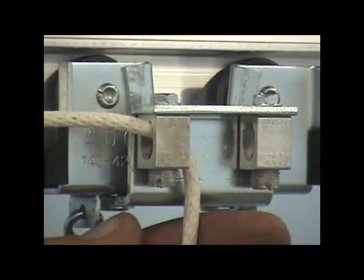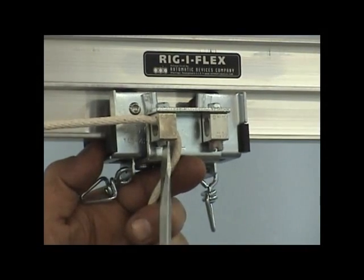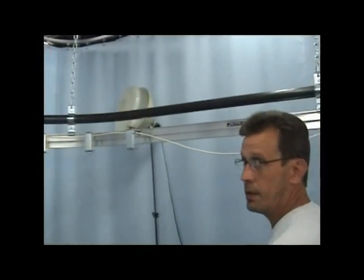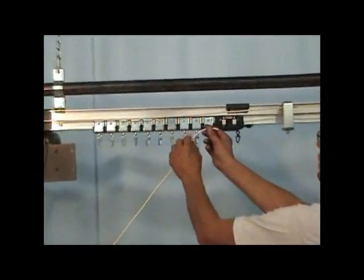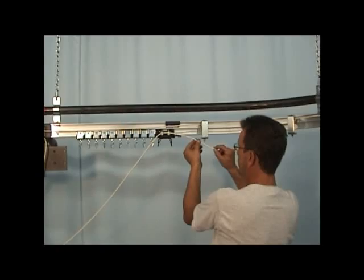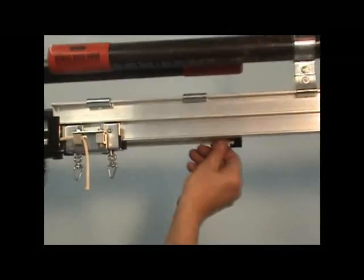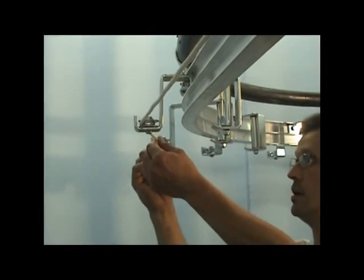Secure the cable at the master carrier. Take the remaining end of the cable coil and thread it through both cable clamps of the knockoff master carrier — do not tighten the clamps. Continue the cable around the outside of the 1458 spindles and toward the center overlap. When you reach the center overlap, thread the cable through the end stop of the live end track section and continue the cable to the 1460 idlers mounted to the dead end track section.